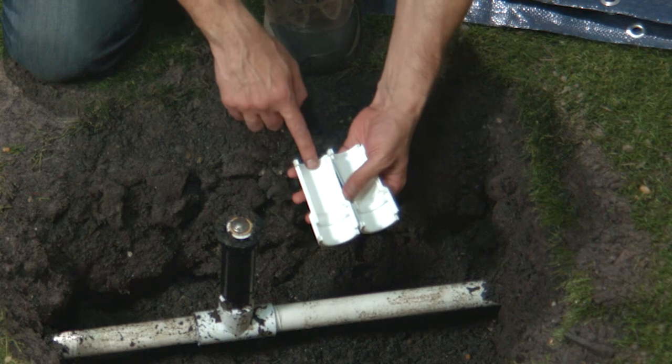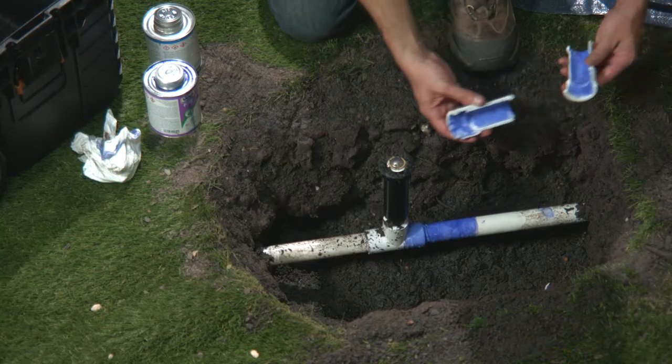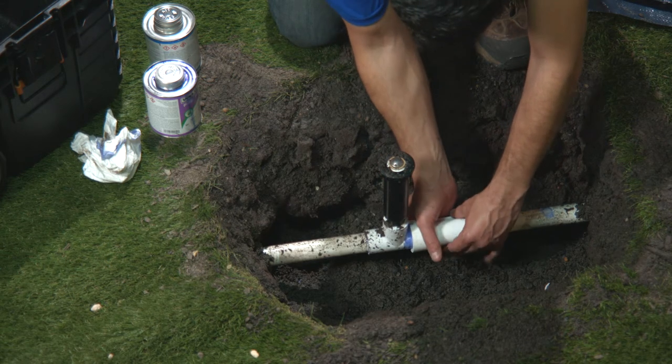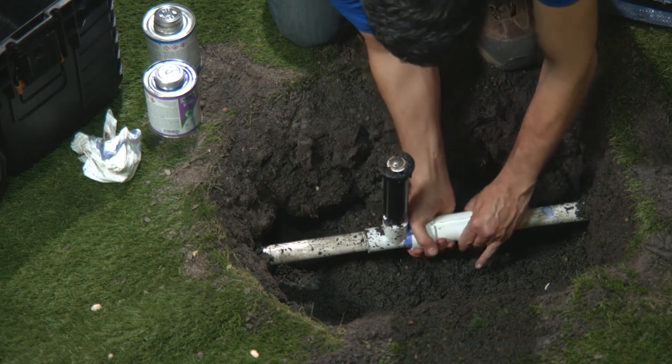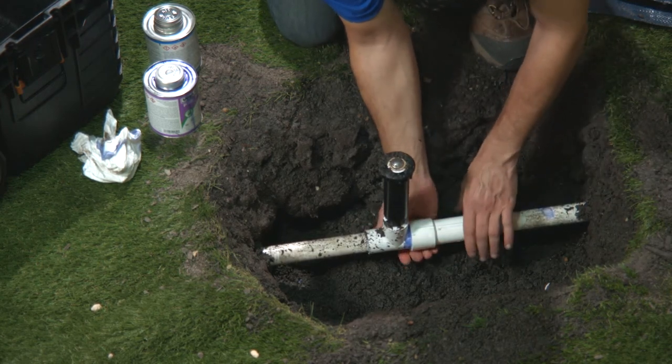The snapper has three internal chamfers that hold in the cement and melt, creating a watertight seal even on a pipe that's slightly out of round. Close the repair kit over the pipe and fixture. Squeeze it tight and rotate it just a quarter turn or so to smear all that cement around. Hold it for 20 more seconds. Check that the repair kit has snapped shut and is seated properly.